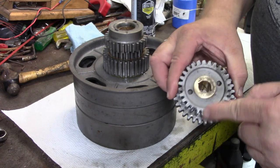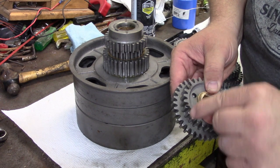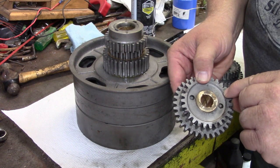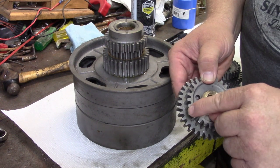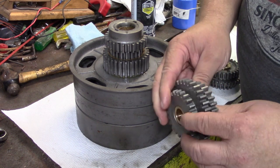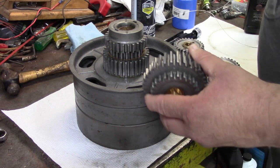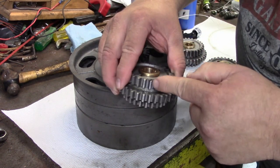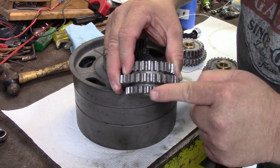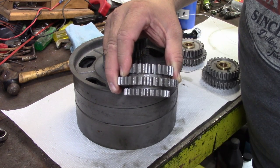On the bushing side of the triple gear there is always one tooth, usually with a U around it — it can be very hard to see. There are also teeth with lines in them; no idea what that's for. But it's the one with the U, where the notch in the tooth is highlighted. This notch, and this notch, and this notch in each gear — and these pairs of teeth all line up. That's the only spot on the gear where they do that.